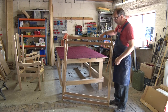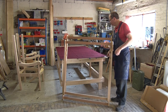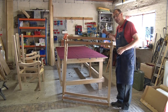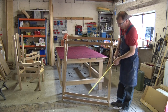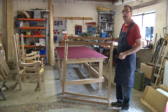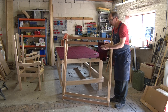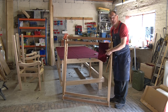The frame is now assembled, although I haven't glued it together yet — that will come later. I'm ready to start thinking about the covering. As luck would have it I've got this fine piece of upholstery material. It's very hard to get deck chair material in this kind of width, plus I think the traditional striped material is rather a cliché — I fancy something a little bit stylish. You need to measure between the rails — that's one metre and five centimetres. Now proper deck chair material is a very close weave and very strong, but upholstery material isn't quite that good, so what I'm going to be doing is making almost like a double thickness sleeve that fits round the rail. I'll sew it at the back and probably down the sides as well.